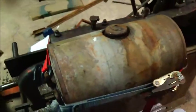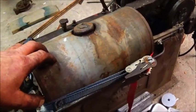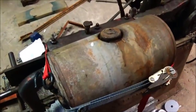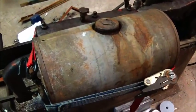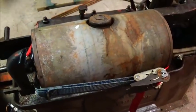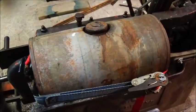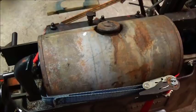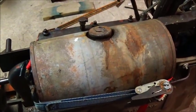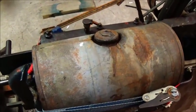Here's the tank we're gonna put on it. This tank is galvanized and it's in good shape, but it had a little rust inside — a little bit of tar buildup, molasses, whatever you want to call it. So what I did is I put some carburetor cleaner in it, some of the old-school stuff, and then I put some bolts, some nuts, and actually a bunch of Woodruff keys in it. I had about ten times as many as I've ever used in a lifetime, so I've got it strapped to the old saw and we're gonna turn it on.